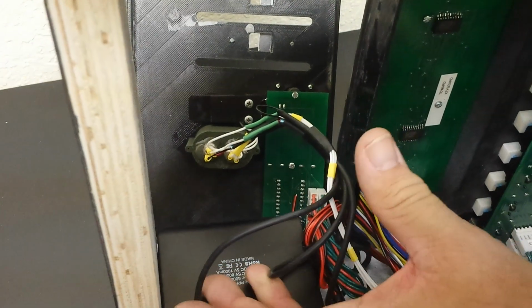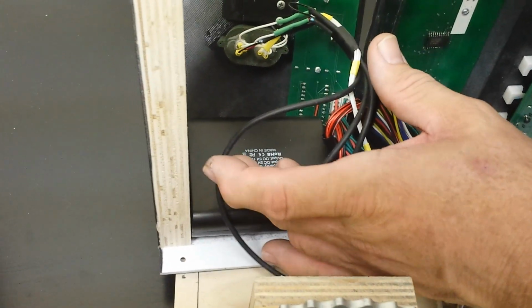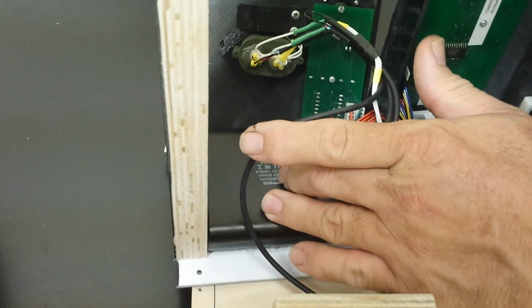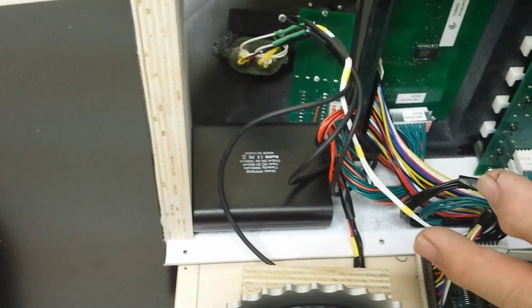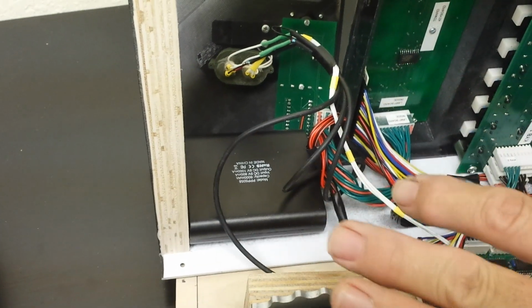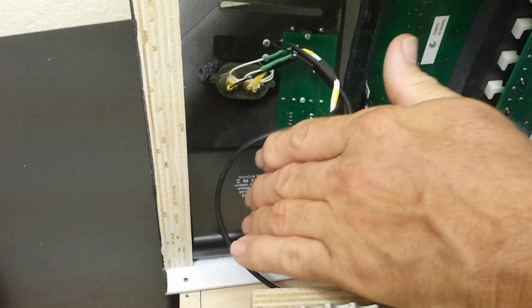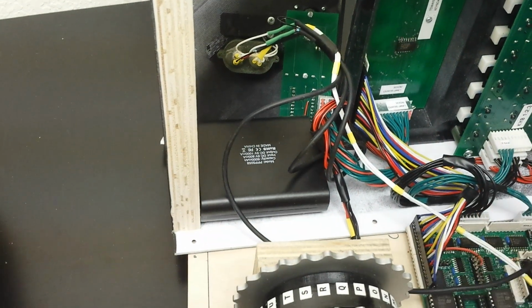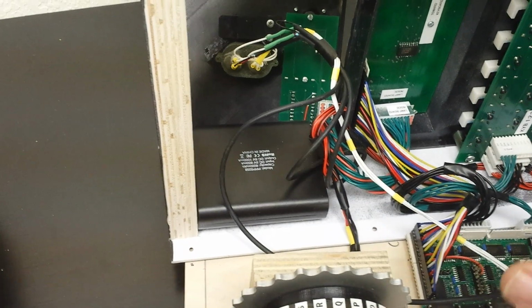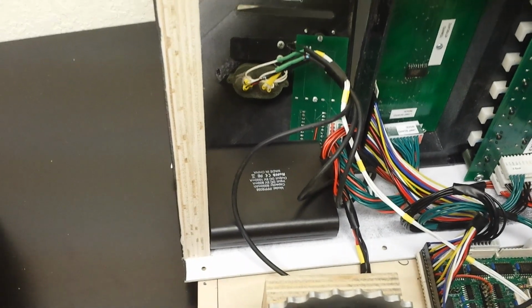We have a lithium ion rechargeable battery, which is typically used for cell phones. They run at 5 volts, which is what the micro runs at, so it's a perfect marriage of current technology and a very lightweight battery. This battery will run this computer probably for about 24 hours continuous, a lot longer if you turn it off when you're not using it.